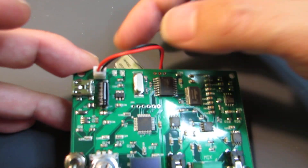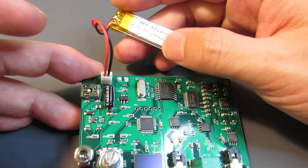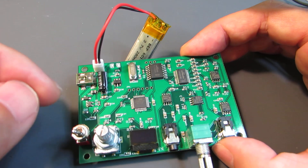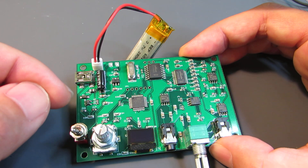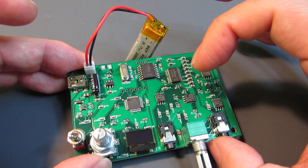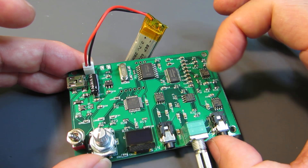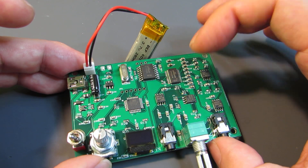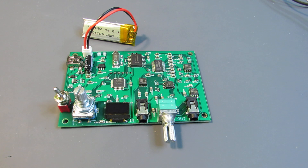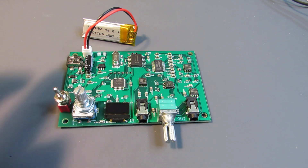So this time I made a modified version which works on just a small lithium polymer battery of 3.7V. On board it has a voltage booster from 3.3V to 5V, and the 5V supplies power to the operational amplifier and the DA-AD converters. And the working is perfect.